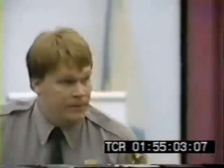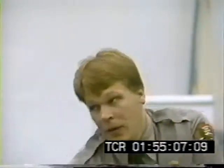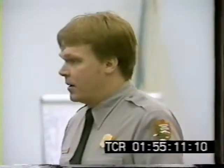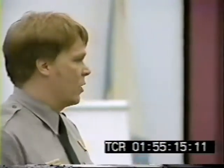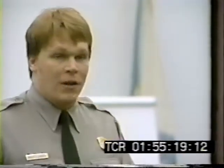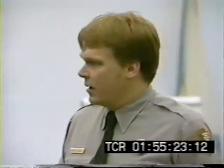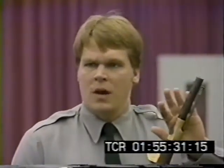This is also a rifle, which means there are grooves cut into the inside of the barrel that turn as they go down to the bottom. And that allowed for great accuracy. Previous to rifles, we had muskets, which were smooth barrel guns. And with a musket, the ball would sit in it kind of loose. When you fired the gun, the ball would bang around the inside of the barrel, and depending on where it bounced last, that's kind of what direction it would take. Very, very inaccurate compared to a rifle.